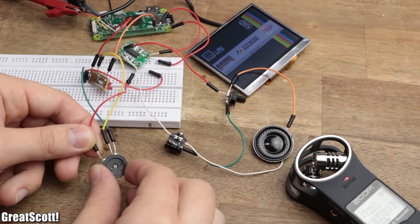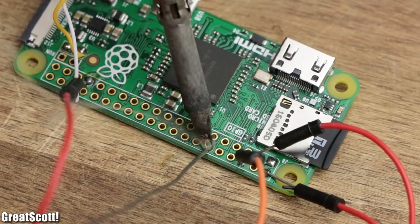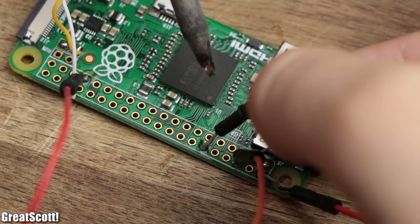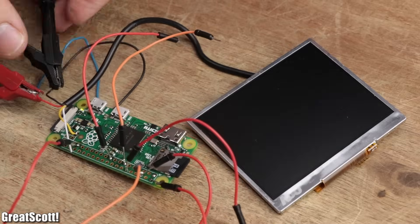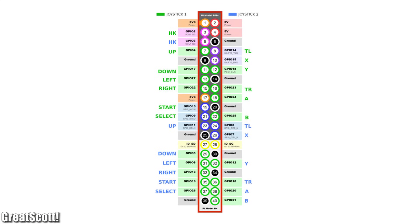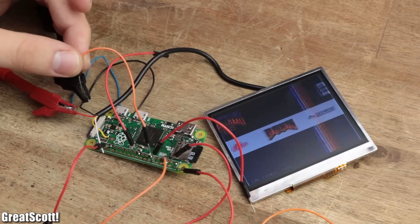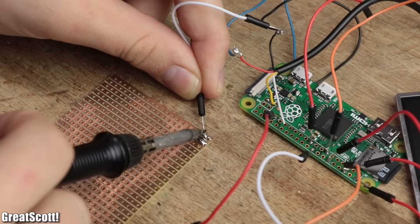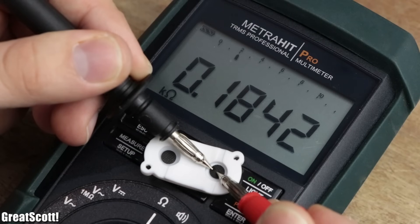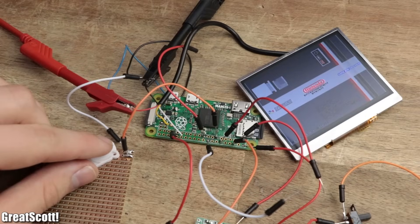As you might have noticed, the sound is only mono, not stereo. The reason is that we need the other audio GPIO for the controls, which we first need to activate in the Recalbox configuration file, but only for player 1. After rebooting the system, the controller acts according to the given GPIO representation — it is basically a matter of connecting the individual input to ground to achieve the described action. I will be using a perfboard with copper strips, on which the conductive material of the buttons will press to connect the input to ground and activate the action.